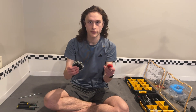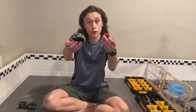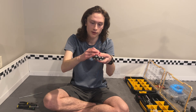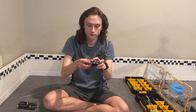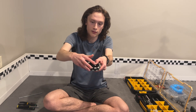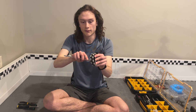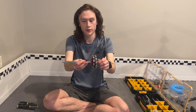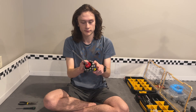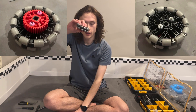So first of all, we're going to start by assembling the wheels for the drive base. You're going to need four of these for this specific design. I'm using high-strength 36 tooth gears and a 3.25 inch anti-static wheel — the older versions will work as well. We're going to start with a 1.25 inch screw. It's very important that you put it in through the gear with the head going through the gear. Insert that into the wheel, attach another screw, and then put some nyloc nuts on the back and loosely tighten them with your fingers. To make sure these are aligned — because there's a fair amount of slop between the gear and the wheel — get a high-strength shaft and stick it through the wheel so there's much less slop. Now we can go ahead and tighten these. And we're going to get four of these.